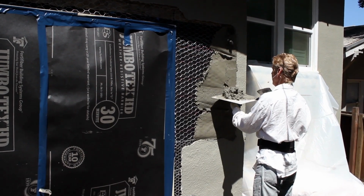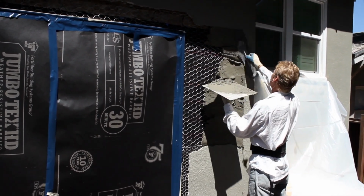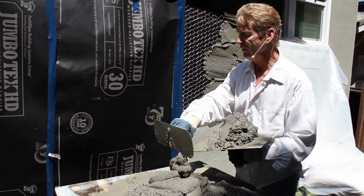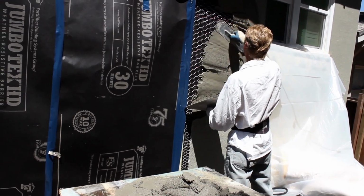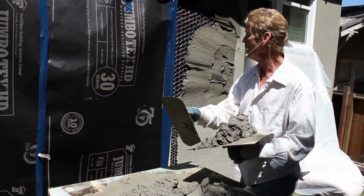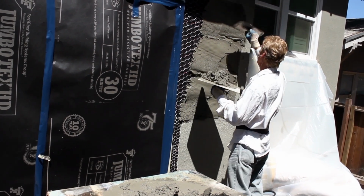And here's another thing guys, the wall we're doing, the patch right here should have 3/4 shear, but it's got 1/2 inch. What does that mean? That means I'm going about 1.5 inches with this stucco rather than say 7/8 of an inch. Is that a big deal? Not really.